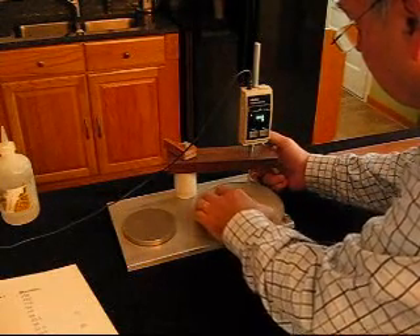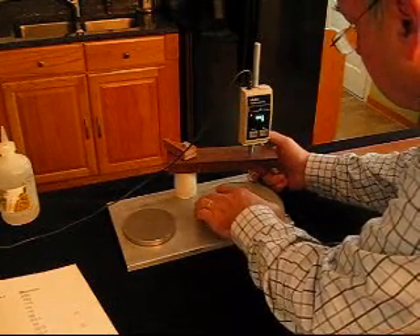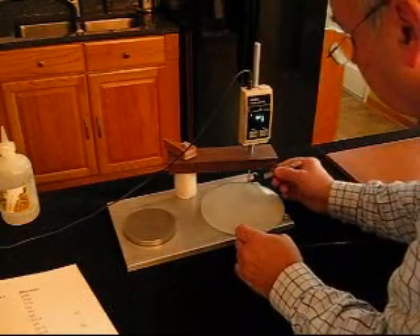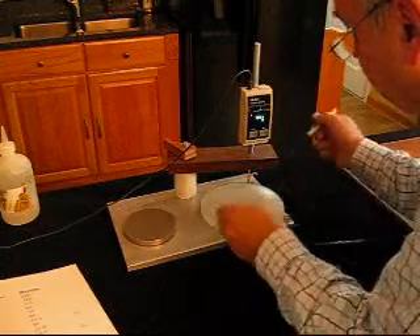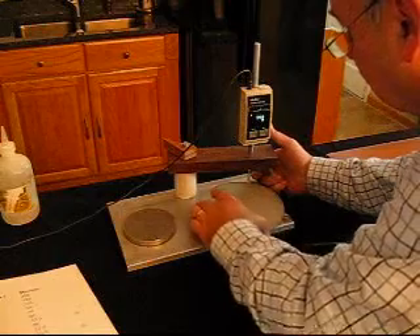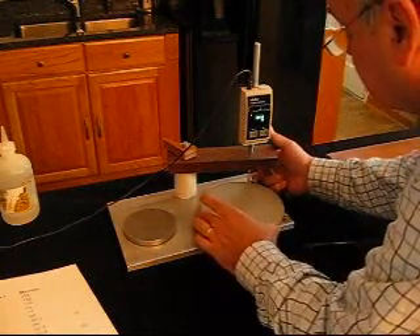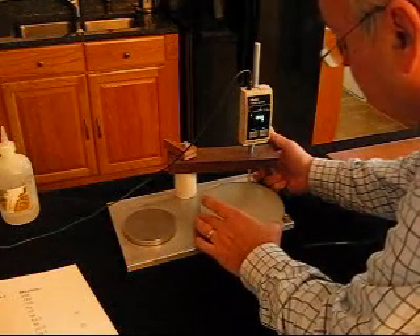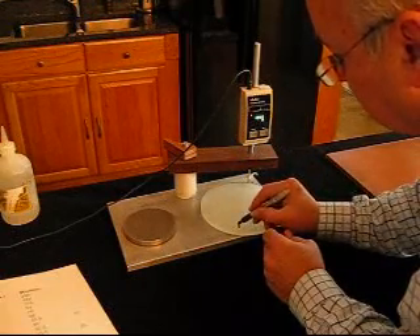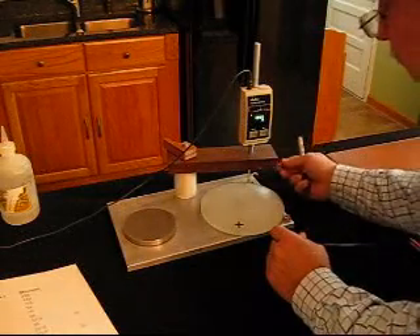There's a good bit over there, and it's starting to go down — that's going to be the high side here. Opposite of that should be the low side. So this side is plus — thicker than that — and you can subtract the difference to see how much wedge you actually have.